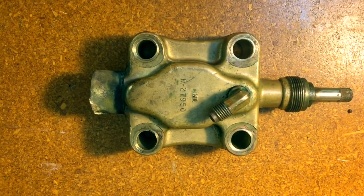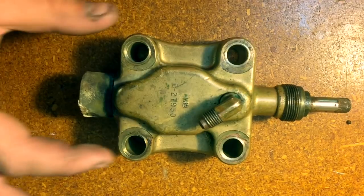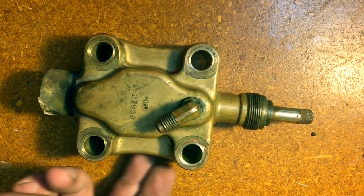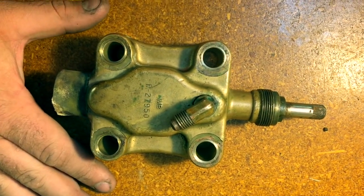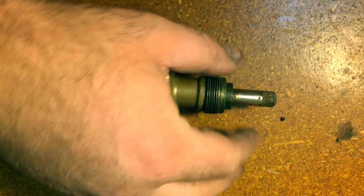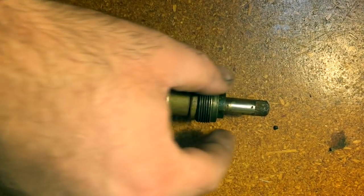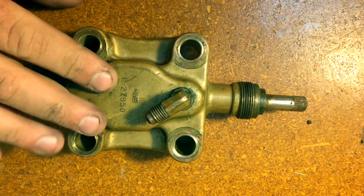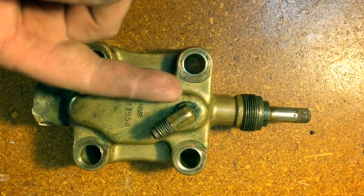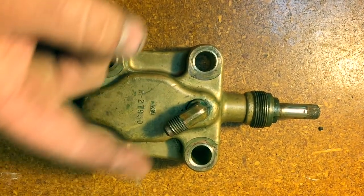Just a quick view from the top — you can see that it's a brass body. It receives an inch and an eighth suction line that would enter right here. You have a four-hole bolt pattern, there would be a gasket underneath here forming the seal between the valve and the actual compressor. You have a threaded stem assembly here — the stem is what opens and shuts the plunger of the valve. The threads here are just for the dust cap that usually covers this. Normally these valves will come from the factory with a plug here; the plug can be removed and you can add whatever direction or style of fitting you'd like if you want to have service ports to put gauges on.